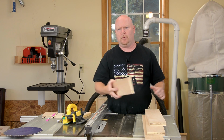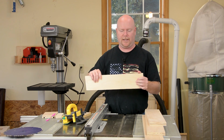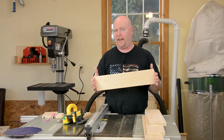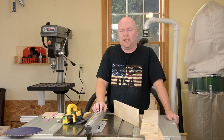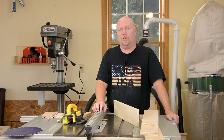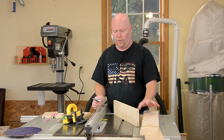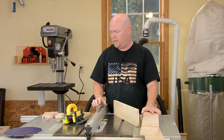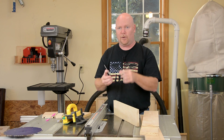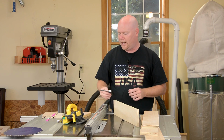All right, the box for the table has four aprons, two short, two long. The short aprons sit inside of the long aprons. It's a simple butt joint on the corner that's gonna get screwed together. And basically what I decided to do was to try the stop dado, and if it gets to be too frustrating cleaning out the plywood with a chisel, then I'll just come back and cut it the rest of the way. I very carefully laid out my two short aprons and the one long apron across the bottom piece that I have, came up with the stick out, if you will, on the bottom piece and divvied that in half to get my groove depth here.